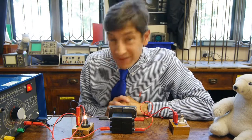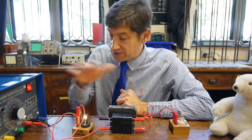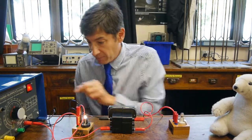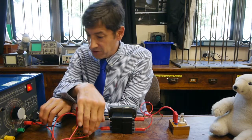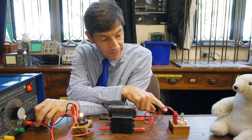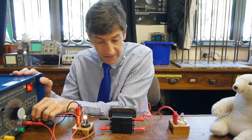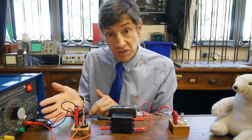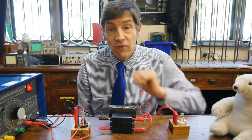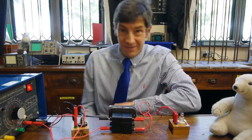Finally, the more observant of you might have noticed at the beginning of the video, where I purposefully connected the transformer to DC. Watch what happens to this light bulb when I disconnect the DC — three, two, one. Did you notice? When I disconnect, this lamp flashes quite brightly. If you think about it: DC is a constant current, but when we disconnect, there's a change in current from the constant value to zero — a drop in current. Changing magnetic fields generate EMFs, so we do get a voltage out of the system for a very short period of time. It's like a tiny blip of AC current.